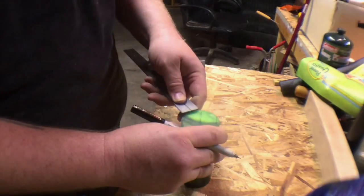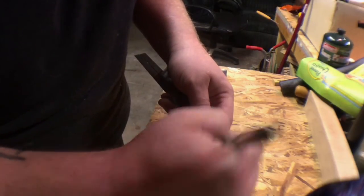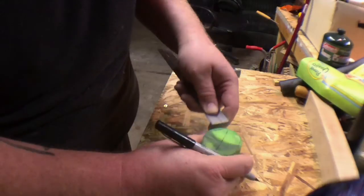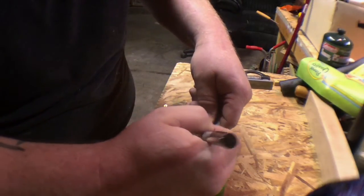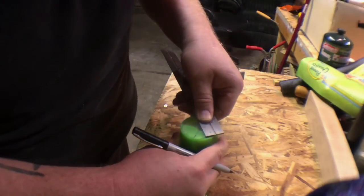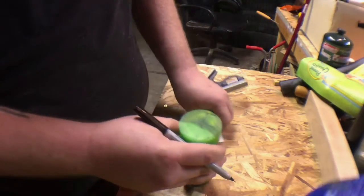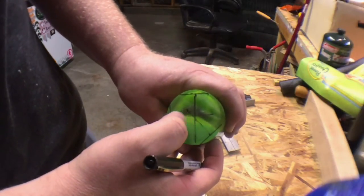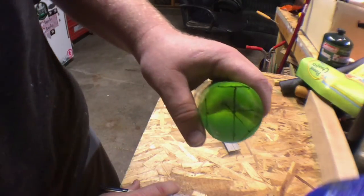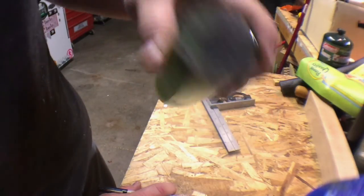If you're not confident, you can do it again — repeat the process, find another area, mark a line. Measure in half an inch, make your mark, take yourself perpendicular off that 90 degrees. And yeah, see, it's not dead on lining up, but you can get yourself close enough — right in that area is going to be about the center of your circle. So if you don't feel like eyeballing it, that's kind of a good way to figure out what you need to do. Then you just repeat the process on the other side and you're good to go.